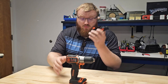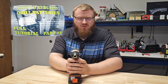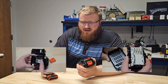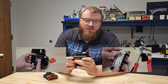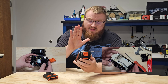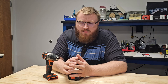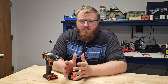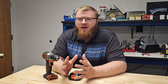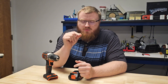In the last video we rebuilt this battery so that it can work with a tool again. I pointed out how this pack, along with the Craftsman pack, did not necessarily have a battery management system in it, but merely a monitor board with a fuse. I suspected the Black & Decker battery pack had cells with a poly switch inside of them. So with no output fets and no real control over the pack, is a drill battery safe? Let's talk about how drill batteries work.